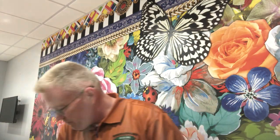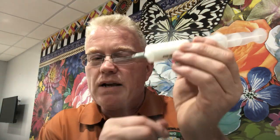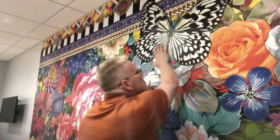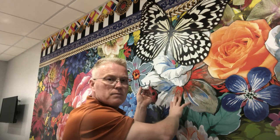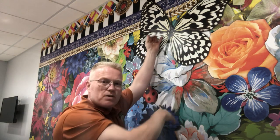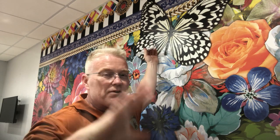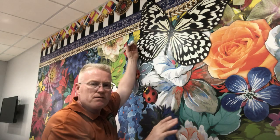The stuff I used initially is only effective when it's not diluted. If you dilute this, I wouldn't trust it. Now because we left it somewhat thick, I'm going to avoid using the tip of the syringe. I'll open the wallpaper up with the tip but then take it off, because I have to put a lot of glue in this area — it's literally completely devoid of anything adhering the paper. You'd go in at the top so that you can disperse the glue easier — gravity will pull it down. If you start on the bottom, it's very hard to push glue upward.